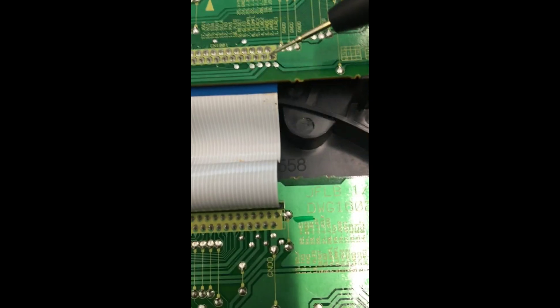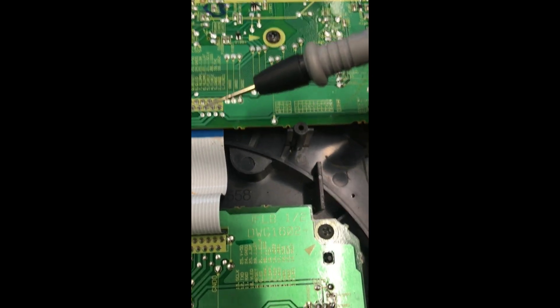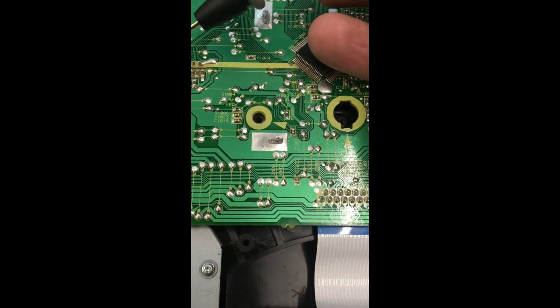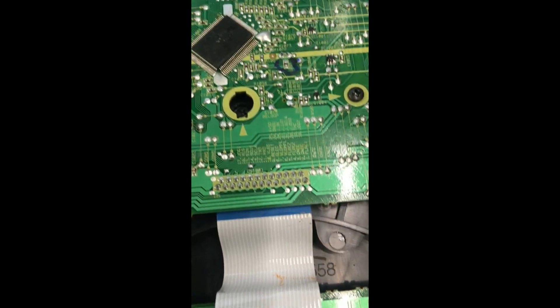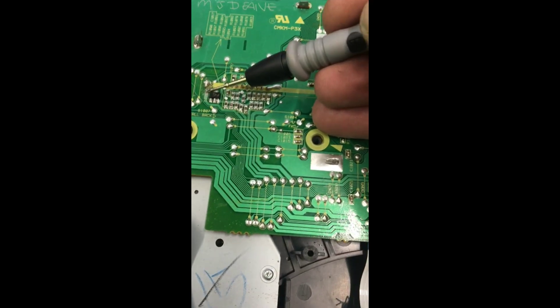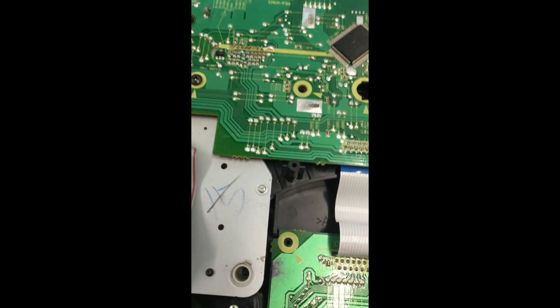You can see the power now — if you've got these four main pins, I'm not sure what the voltages are, it'll be 12-volt, 5-volt. I know there's a 48-volt circuit for the fluorescent displays. On the main connections of the fluorescent display, you've got this bunch, which is actually controlled by this chip, which is illuminating each element within the fluorescent display. And then you've got the live — I've tested for ground — you've got ground there, you've got another ground there. This is not connected to this trace — that's the fault. Why this has happened, I don't know. But we're gonna run a wire from here to here and we will see what happens.